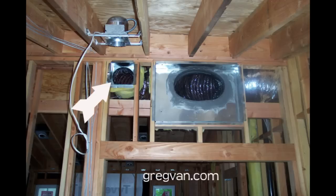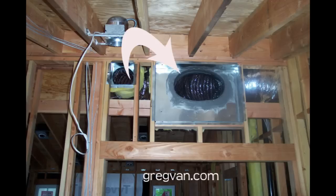The problem is because they are too close to each other. You don't really see this a lot — this isn't something you're going to run into every day. And there's a reason why: the air coming out of the duct on the left is just going to get sucked right back into the return air duct on the right.